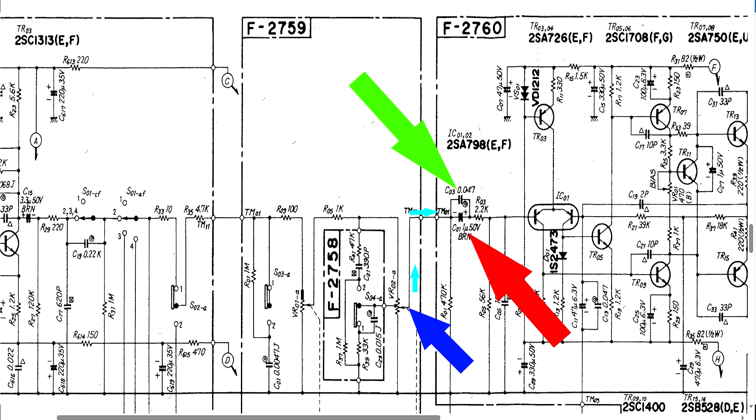If I just put the circuit up on the screen - as you can see it's a one microfarad capacitor rated at 50 volts as indicated by the red arrow. The green arrow is also showing you that in parallel with it is a 0.047 microfarad capacitor - something like that - that runs parallel to it. I don't usually get that in the other amplifiers I've got.